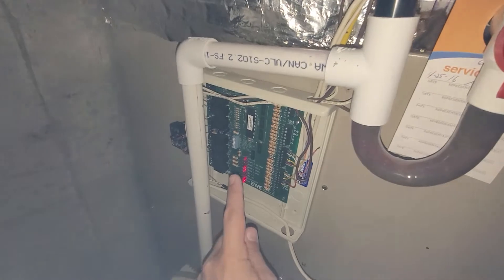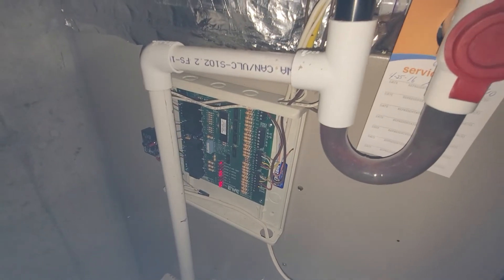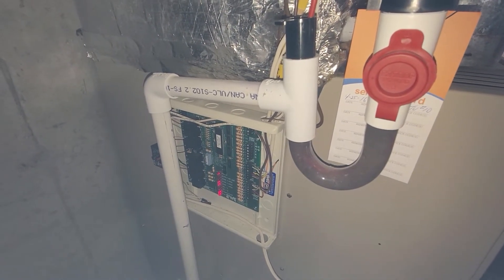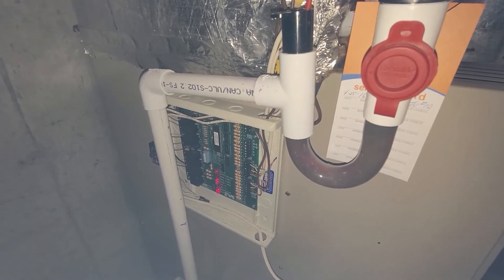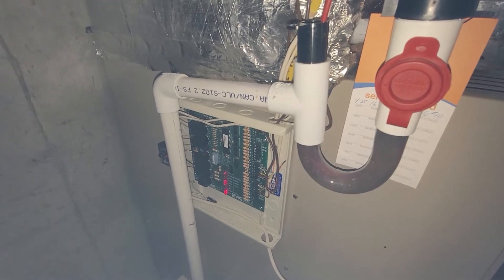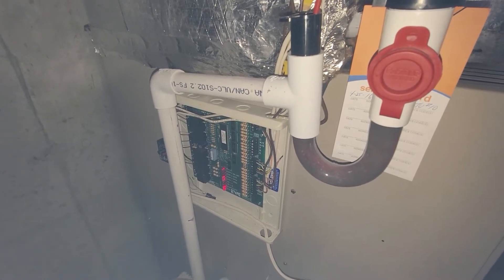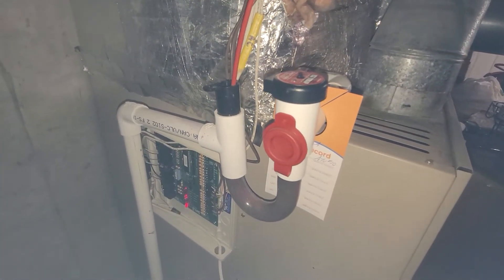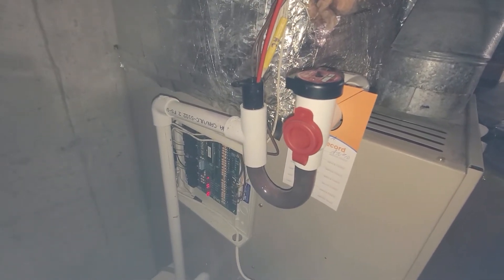The board, the NCM300, also has a delay start of two minutes. But if I have both thermostats active, what will happen is I only have two minutes in between cycles before the system calls for cooling again. That was not comfortable for me with the compressor starting up almost every couple of minutes, especially with our first major heat wave of the season coming — consistent 90 degrees plus for about the next week.